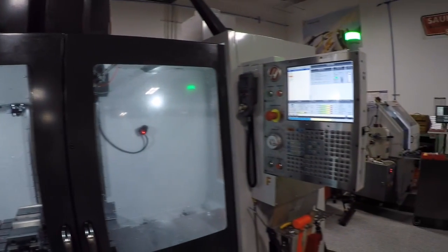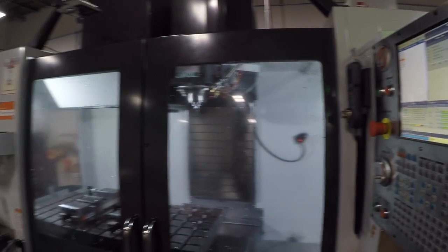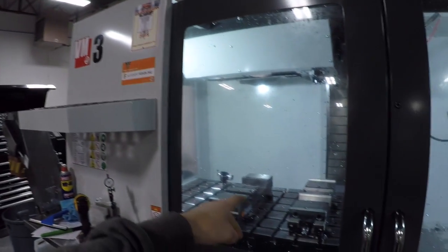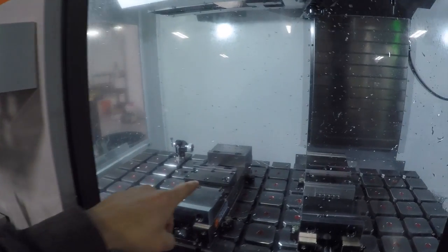So what's going on today in the shop? Every morning when we come in, we have to turn the Haas on and warm it up. I want to figure out how to automate that, because turning it on and letting the servos spin up takes about one minute, and then you've got to run a 10 to 20 minute spindle warm-up. I want that to just be done when I get into the shop. I'm actually going to start filming a Wednesday widget where we make a part on the Tormach that we're going to use in our Haas — with these talon grips.